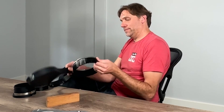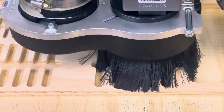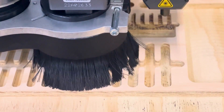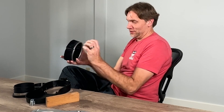Other material choices — we mentioned the steel-backed bristle ring. This is galvanized steel, and that's important both because it's magnetic so it snaps into the magnets, and also because this crimp is exceptionally strong — these bristles are not going anywhere. On cheaper dust shoes, a lot of times there's assembly required where you jam a brush strip down into a molded plastic channel, and the brush strip can pull out over time. That's not going to happen with this, so it's a super simple but effective solution: a magnetic band that also holds the bristles in place without a bunch of extra parts.